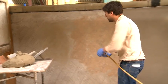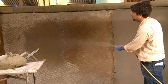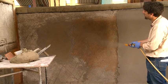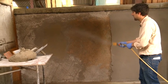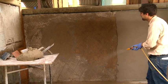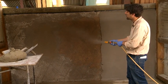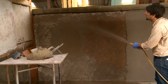When you're working on site, it's always a bonus if you have a hose pipe with a nozzle like this. If I was doing this with a pump, that would really take quite a long time. I'm just going to wet the whole wall down and you can see it's gone different colours. As we do our training courses, the different mixes have been used, so that's what those different colours are. You can see I'm being very generous with the water, and often on jobs when we have very dry walls, we will go the day before and start to water those walls down to make sure there is enough moisture and not too much suction.